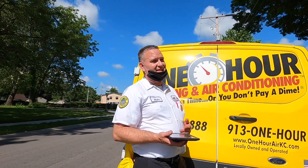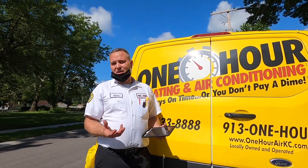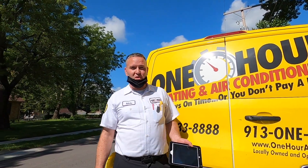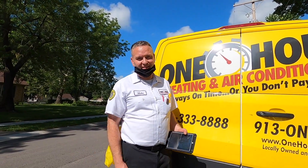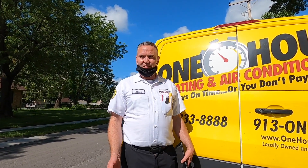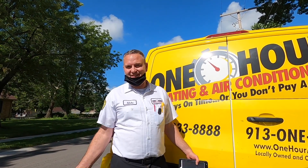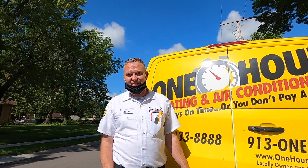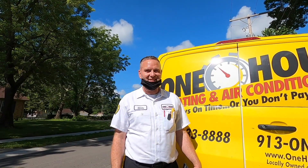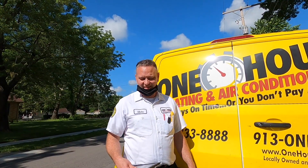They called because it wasn't cooling. When it freezes up and becomes a block of ice, it's not pushing any air through — it's not moving room-temperature air or any air at all, it's just frozen. It'd be different if it was a little frozen and still moving some air, but this is a solid block of ice. It's over 80 degrees outside, so it's just hot, stale, and muggy inside. The number one reason a system breaks down is lack of maintenance.